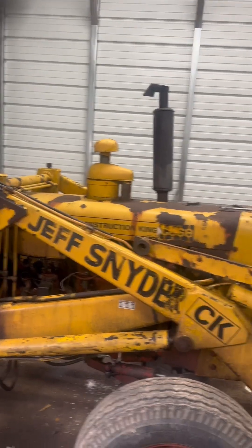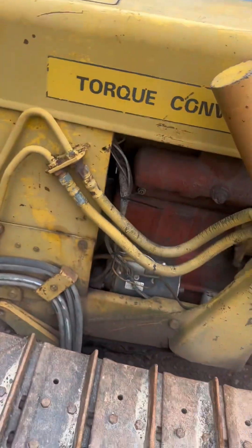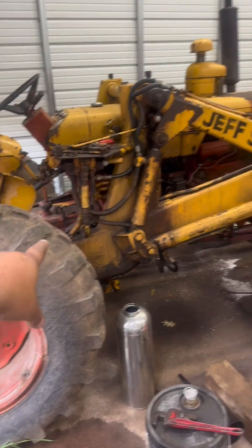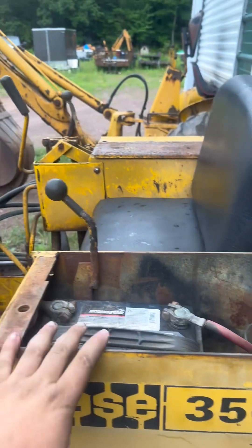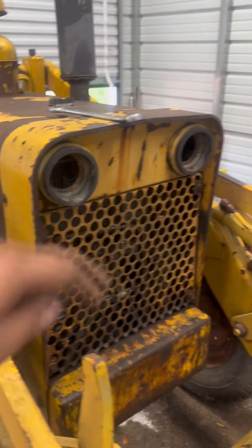That machine does not need a fuel pump because the fuel tank is right on top, so it definitely gravity feeds. I had the battery charger hooked up because the generator does not work, so I'm just using it for the serpentine belt. I just charge up the batteries and I'm good for a long time. There's practically nothing electronic on these machines - once it's started, everything is mechanical. That machine has only one battery. This dozer has two batteries, which is good since I use a little electricity to run the fuel pump.